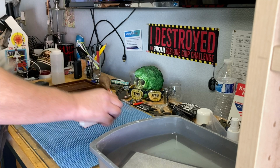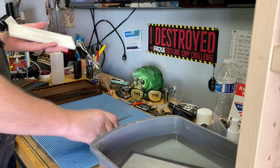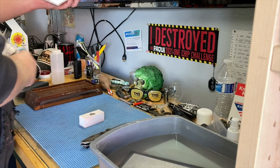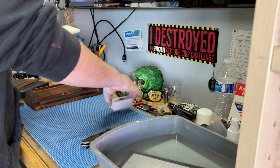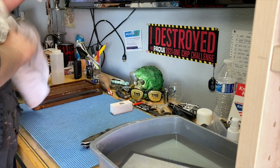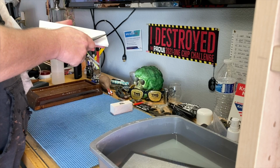So what I'm gonna do first is I have an ultra fine ceramic stone here, and we're just gonna do a couple quick passes on that just to make sure that we've knocked off any burr. Always make sure that you wipe off your stones and that there's no grit. This is kept in a drawer with a bunch of other sharpening stones, and I don't want any of the big chunks of grit that may have come off the other stones to be on this, because you'll get a scratch in your already done edge. And then you have to go back and figure out why you've got nicks and stuff like that. And typically it's just grit contamination.